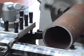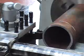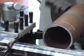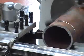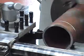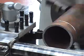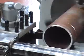I'm going to watch to make sure it doesn't move and doesn't come out of alignment. I'm just going to take a light cut off the outside at a slow RPM to reduce vibration, because I want a smooth finish — my steady rest has roller bearings on it, and if the finish isn't smooth it's going to cause problems.